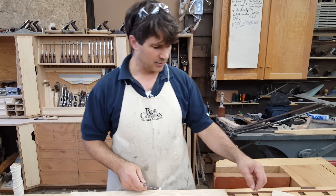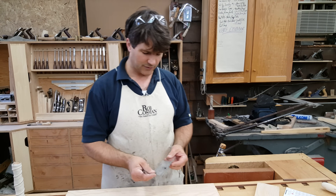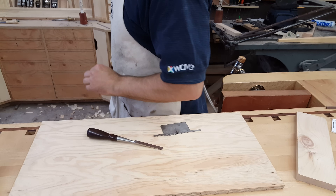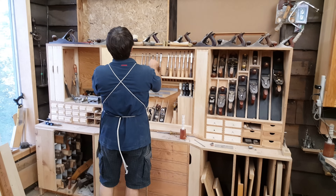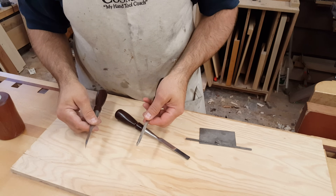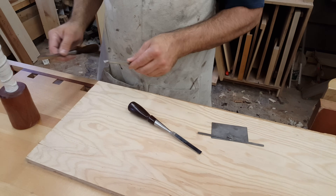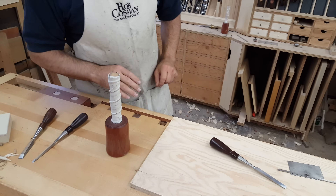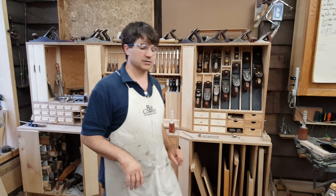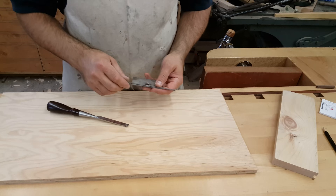So I'm going to show you how I did that and then show you the results. I've got a protractor and I'm just going to measure this one first — I just took this off my chisel rack. I typically keep two chisels at 17 degrees, a half inch and a quarter inch. You can't use those in hardwoods, by the way. But I happen to have two three-eighths inch, so I'm going to do one of the three-eighths as well and show you how I grind it.